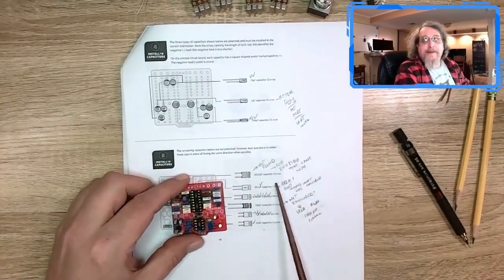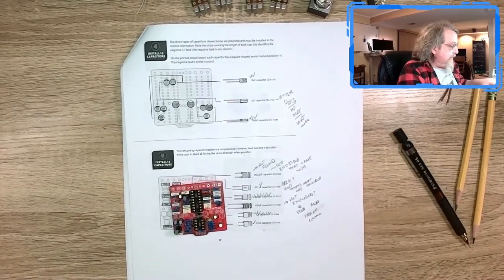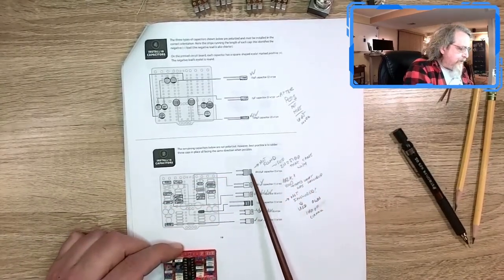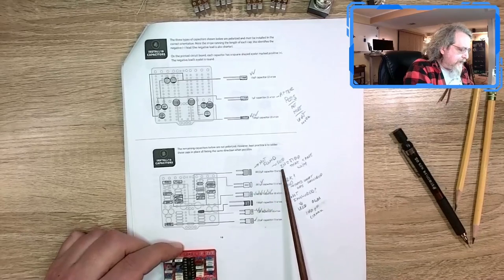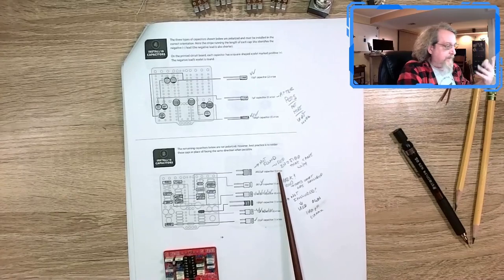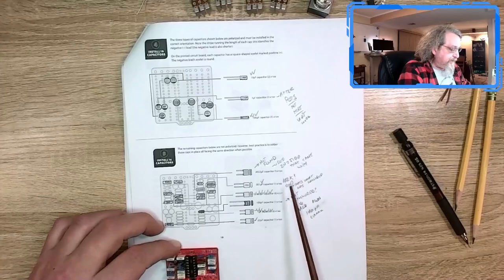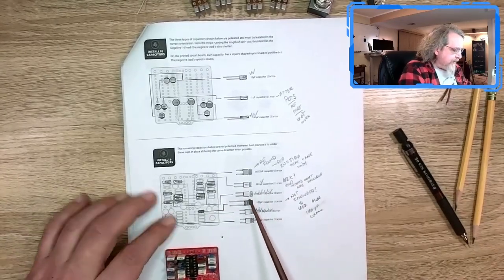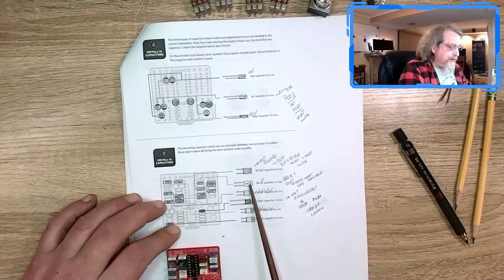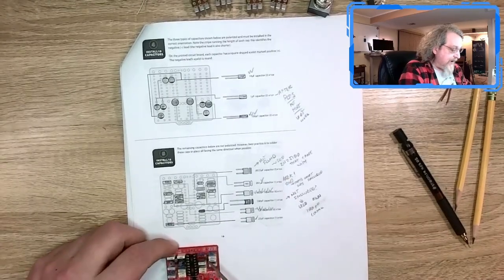You'll notice the notes down here. Here are my notes for these capacitors. The number on this one has a JN163 in it, and that's literally not anywhere in the kit. The closest is a J100, so I used that. Most of the other ones were present and labeled. This one was confusing. They say it's a 102J. The only thing in here is a 102K, so I assumed that was close enough, and I used that here.